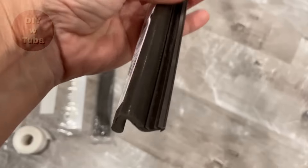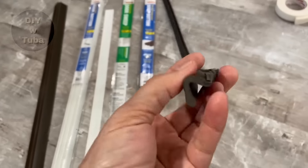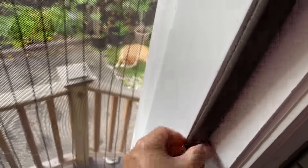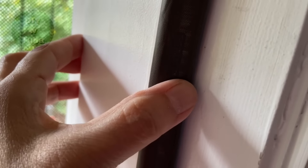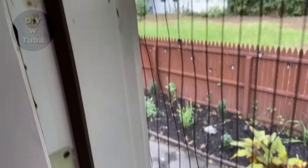How about around the doors? I already have this weather stripping installed on all my exterior doors and am very happy with it. You have to have a grooved door for this to work — meaning this thin groove runs along the door. The flat part is just pushed into this groove, and when you close your door it provides a nice airtight seal between the door and the frame. You can find all the materials I used in this video in the description section below.